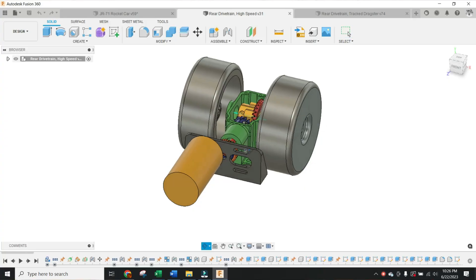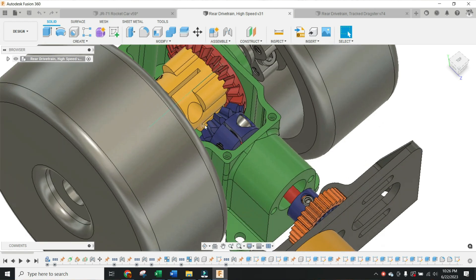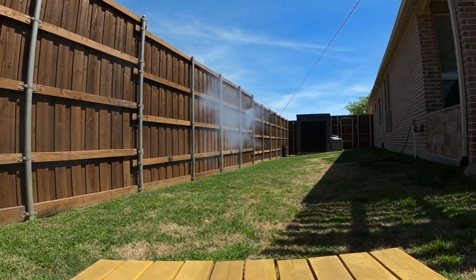I've started on a new design that uses an electric motor for primary propulsion but will have rockets for boost stages. That way I have the motor for braking and a lot more weight so it can't lift off, but I still get the acceleration from a rocket to hit maybe two or three G's before I have the benefit of downforce. I'll have to find a way to add some front end suspension and will never go back out with a thrust-to-weight ratio of 12 to one. Wish me luck on the redesign and see you soon.